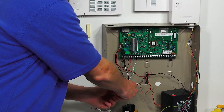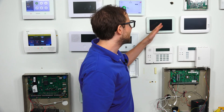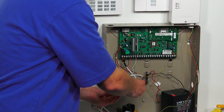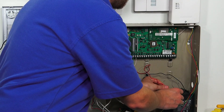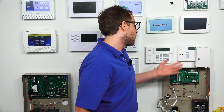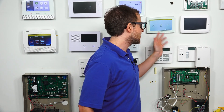In our case, we're lucky enough to have a Honeywell LT cable, so we can just undo the barrel connection like that. And you can see that our system is powered down — we don't have power to the system anymore, which is why the keypad is also shut down. To complete the power cycle, we have to power the system back on. We want to do transformer power first — AC power — so we'll plug this back in. The system will power on AC power alone. You can see it is starting up. We'll go ahead and reconnect the backup battery: just take the red wire, the positive wire, right into the terminal. If you cut AC power by unplugging the transformer, plug it back in. If you cut power at the circuit breaker, flip the switch. You can confirm that your system is powered back on. That is how you do the power cycle on a wired system.